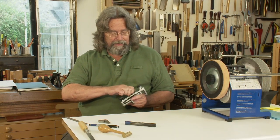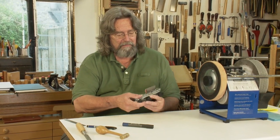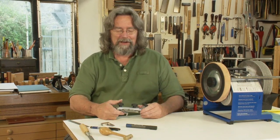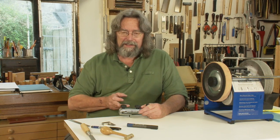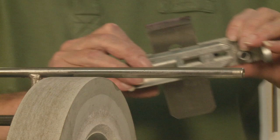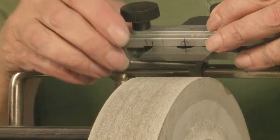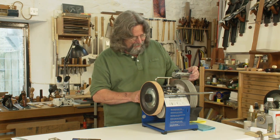An interesting modification. I've gone and tightened up before I've checked the squareness — well, I've been lucky this time, that's virtually perfectly square. If it wasn't I'd slack off one of the knobs and use my little hammer here to just tap the end. So over to the machine. The projection for a particular angle is defined by how far above the stone you have your support bar, so it's no good my telling you what mine is — you have to work that out for yourself.